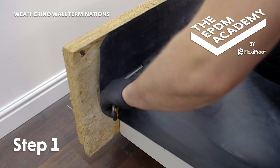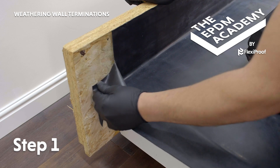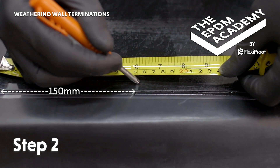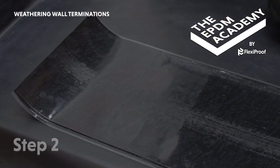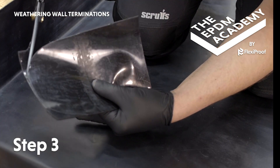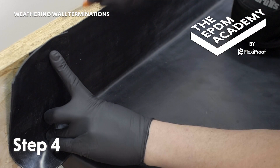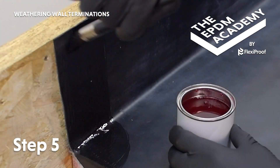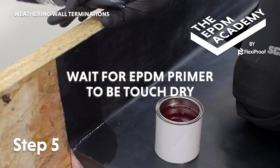Use a craft knife to cut the membrane at a 45 degree angle at the wall termination where the roof deck and fascia meet the wall. Use a scribe to mark 150 millimetres in on both sides of a piece of 9 inch (225 millimetres) uncured flashing tape. Use scissors to cut the tape across these marks and create a 150 millimetre wide patch with curved corners on one end. Position the patch as a guide, use a scribe to draw around the patch and create a prime line. Use a paint brush to apply EPDM primer within and 5 to 10 millimetres past the prime line.